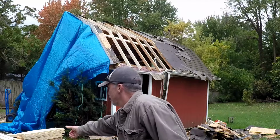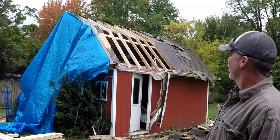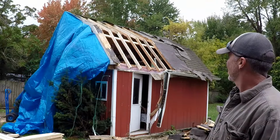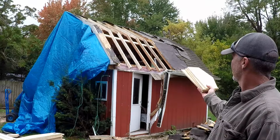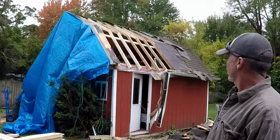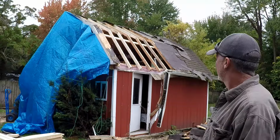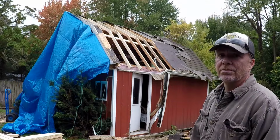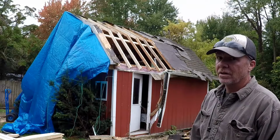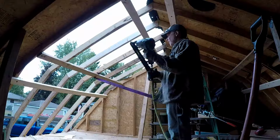I've got a bunch of plywood gussets cut, a bunch more up there. We are going to tack these in, get those brackets nailed up, and then I guess we're gonna have to figure out the overhang so then I can start getting some OSB on. But the big conundrum, the rafters, seem to be solved, I hope. A lot of hope in this job. About all I'm going on here.